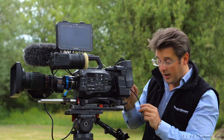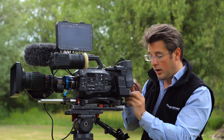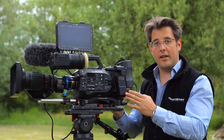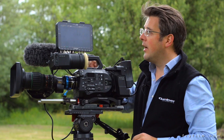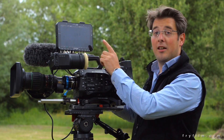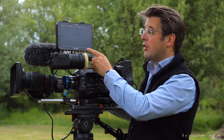The first thing to do is plug your 7Q into the RAW output on the back of the FS7's dock. Make sure it's a 3G cable — it's got to be the right cable, otherwise it can muck up the recording on the 7Q.